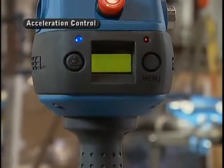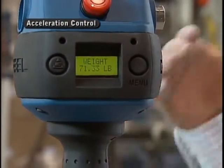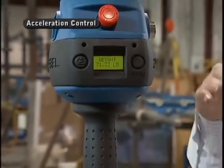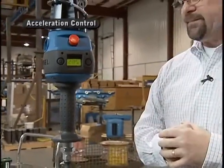One of the benefits of that is if you have it on a structure overhead, say on a long bridge, and you have a little bit of deflection in the center, you can actually reduce the amount of impact that this unit will put into the bridge and minimize the bounce of the bridge.